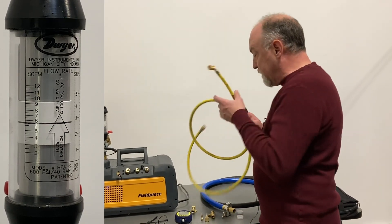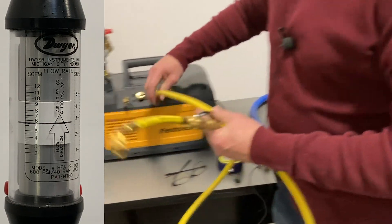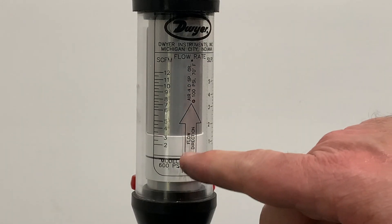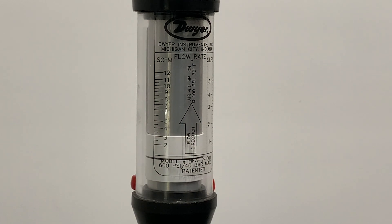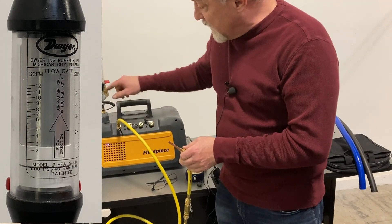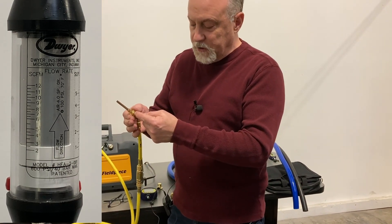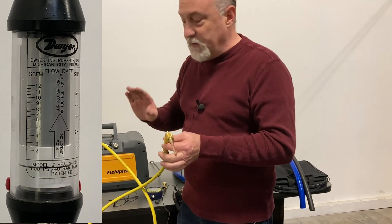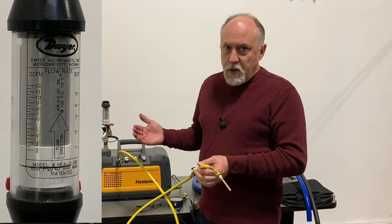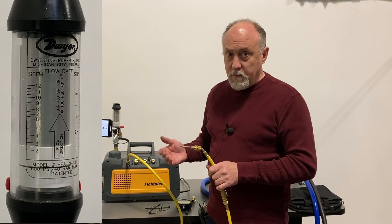So the quarter-inch port will still move a lot, but what happens when we hook a quarter-inch hose up to it? Here I've got a quarter-inch hose, a ball valve with a standard depressor in there, and we're just going to test the hose by itself. When I connect the hose, you can see — and hear the difference in the pump sound too — that our flow dropped down below one CFM. If I hook a Schrader core port to this, the flow gauge barely changes because the flow is so low. There's a Schrader port restriction, the depressor is a restriction, the ball valve is a restriction, and a quarter-inch hose — so I've effectively taken my 8 CFM pump and turned it into less than one CFM. I don't care whose quarter-inch hoses you use; this is a major restriction to viscous flow, and even more so to flow in a deep vacuum.